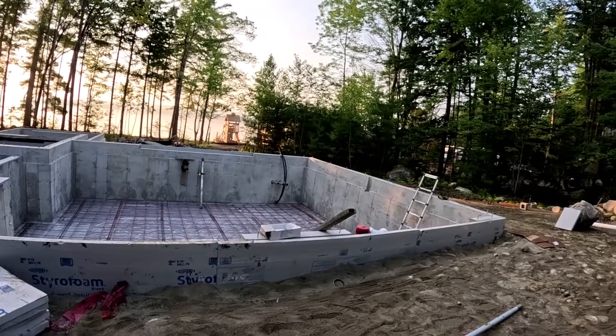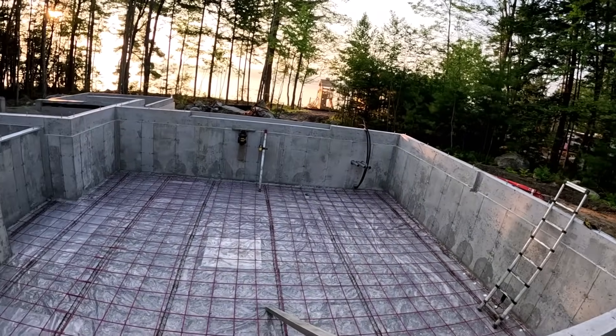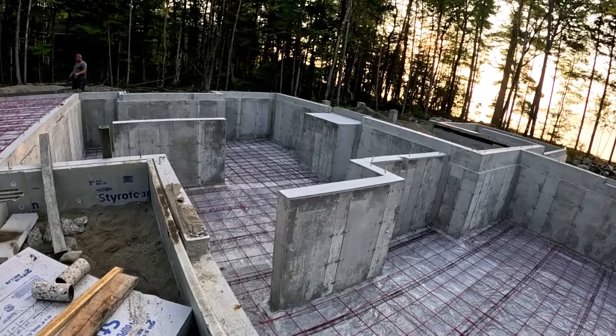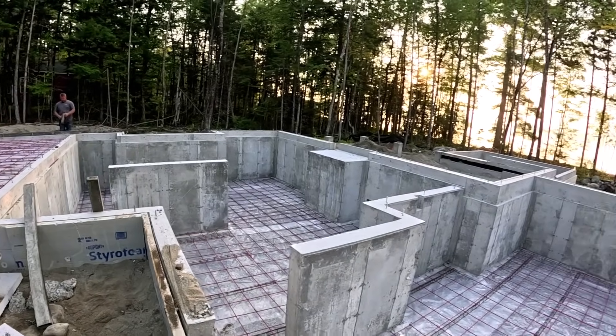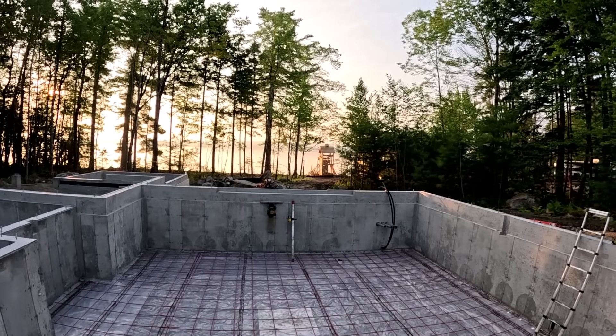It's number four pink bar, which is fiberglass rebar, and a four-inch concrete floor, which is pretty normal for us. The two inches of styrofoam underneath the concrete is code, so that goes under basically almost every single floor we pour here in Maine.